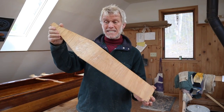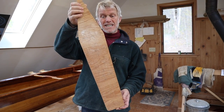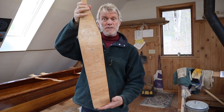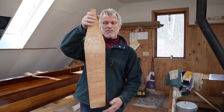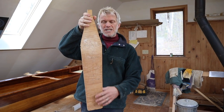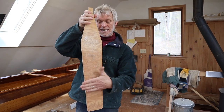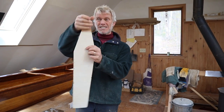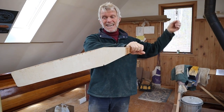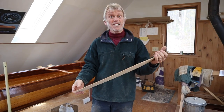This is the shape of blade that I like to make and use. It belongs to the otter tail family. It's great for deep water, no good for shallow water, but on deep water lakes you've got a big area. I prefer it to the beaver tail — beaver tails have the wider part down at the bottom. This has the widest part, the biggest area, nearest the lower hand, and therefore puts the least strain on your joints. So it makes paddling easier.